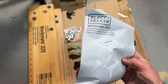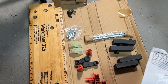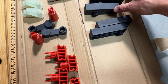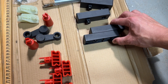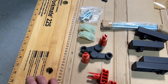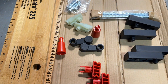If you know anything about these, or as you might be experiencing right now, the instructions for these can be problematic. So this video will step-by-step show how to build one of these. Here are all the parts. Make sure that you recognize that these two black pieces are different than these two black pieces — that causes a lot of confusion. Also understand that these boards are oriented differently from one another, so you want to be careful how you install them. Those are the two things that can cause a lot of frustration, along with lining up these pieces right here.